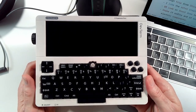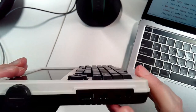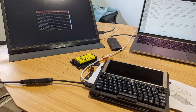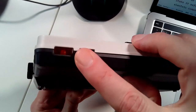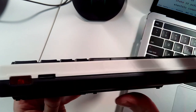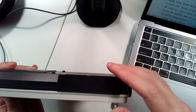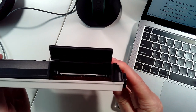If we take a look around the DevTerm, you'll see we have some ports. There's a USB port, a USB-C, micro HDMI for video out, and a headphone jack for audio out. On the front, we have our power button with a built-in LED and the SD card slot for the operating system. On the right side, there are two more additional USB ports. And on the back, we have an expansion port, which right now is used for the thermal printer.